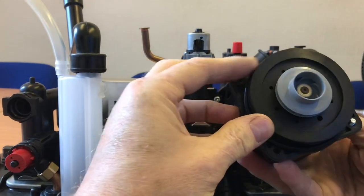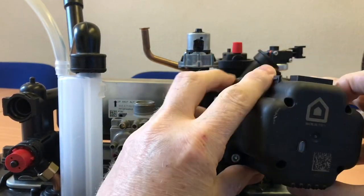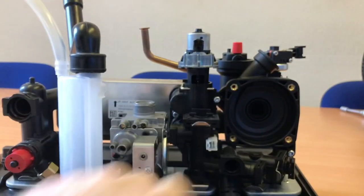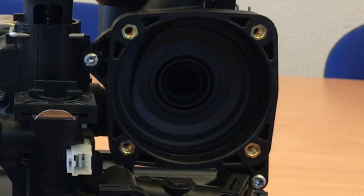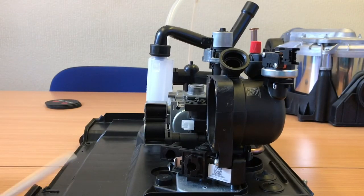You can now see this is our ERP pump, and you can see inside the housing how straightforward it is. That's removing the pump head - again incredibly easy. Now I've turned the block onto the side. The side panels on the Ariston boiler are removable so you could still do this as long as you've got access - just easy to film this way.